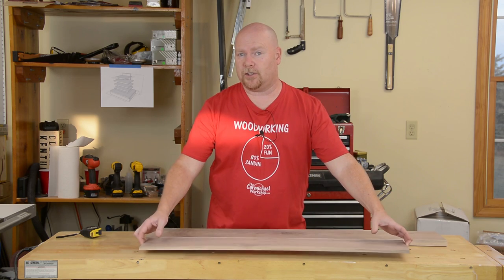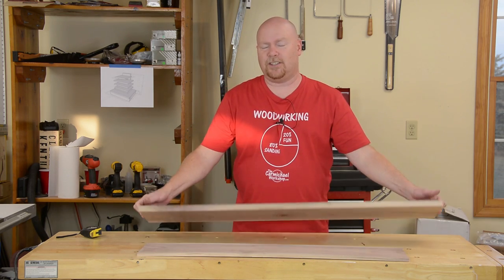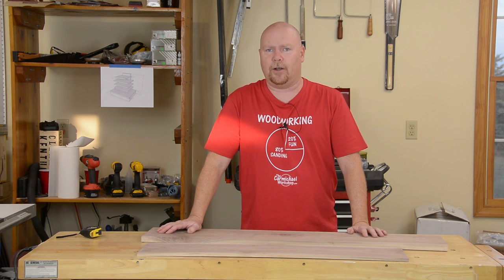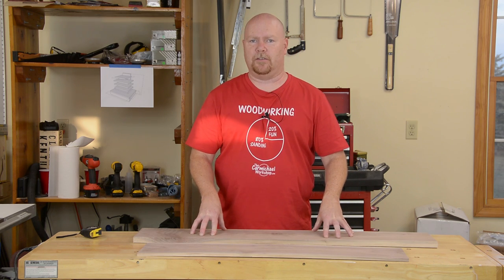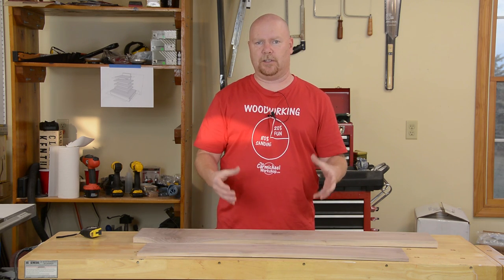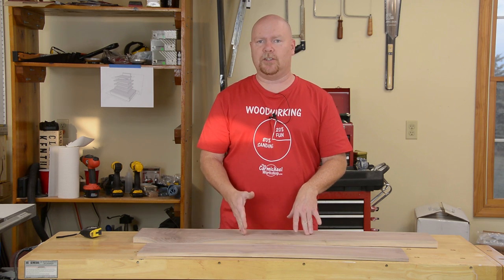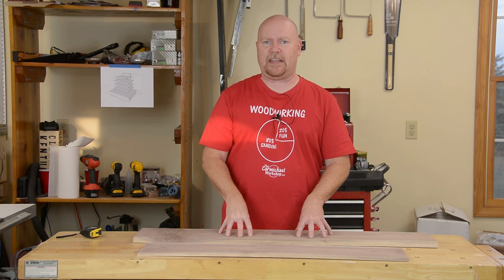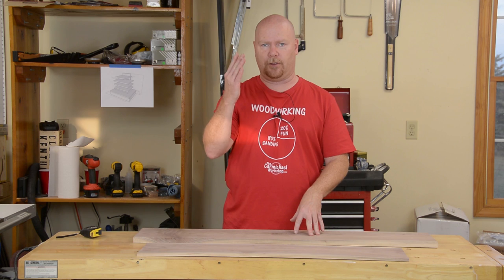This piece right here is 3/8 of an inch thick, and this one is just a hair over 3/4 — it actually measures closer to 800 thou. The way this stand is designed, the heavier, thicker stuff is going to make up the base to give it enough weight to support everything stacked on it. It's also the upright post that goes up the back, so I have enough meat to dado in the thinner shelves and still have enough strength in the support post.